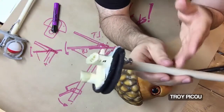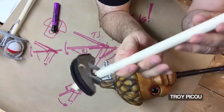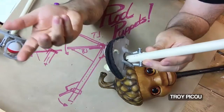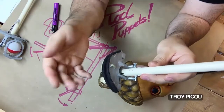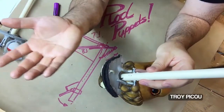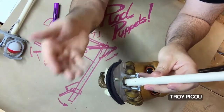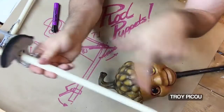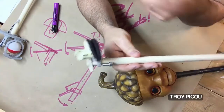This concept allows you to make anything into a puppet. You simply hook some type of cable mechanism — here I've printed a little eye on the bottom, but you can use an eye screw, a small nail, a bolt, or just poke two holes and tie a knot. However you choose to do it and whatever materials you use for your jaw plates, you just tie a string, pull it down to a trigger, and set it off. Pull — opens. Release — returns, closes.